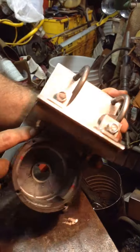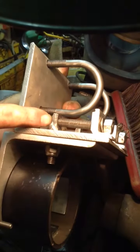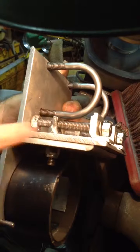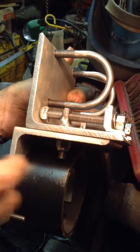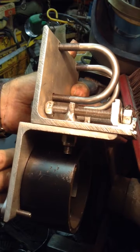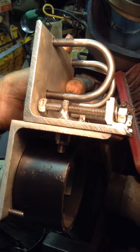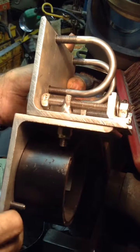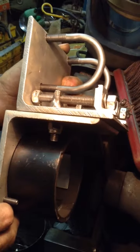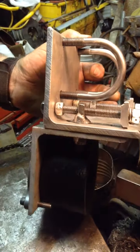These are safety nuts that are bound to these bolts, which are the adjuster bolts. This allows this shelf here to move in and out and align our motor with whatever chain sprockets we're going to put on it. This way we've got an inch in either direction to adjust the thing to get what we want out of it, instead of having to rebuild another unit each time we figure out it wasn't quite where we wanted it.